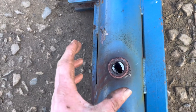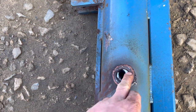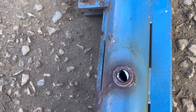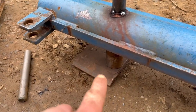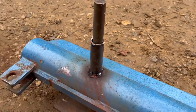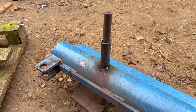If I can get it sat on something solid — the only thing I'm lacking is someone to hold the punch for me. So I've tacked another bit of tube on there to hold the pin so I can give it some good smacks. I've got a bit tacked on the bottom to support it around the tube and a bit tacked on the top to hold my pin. Hopefully now a good few smacks and that should come out.